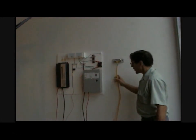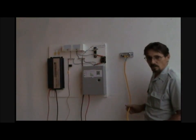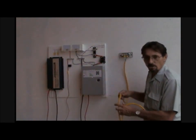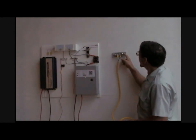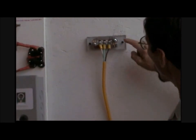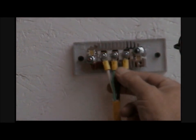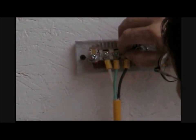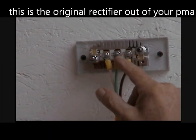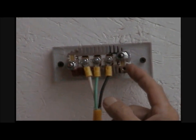Here's our charge controller board. Say we decided to use the three-phase AC outlet on the wind turbine — here's our extension cord, it'll just come into the garage, your shop, or wherever you've got it. This block is a bridge diode; it gets mounted to the wall. This is your extension cord from the wind turbine, and the wires just bolt onto the block like so. It doesn't matter which way they go. What this block does is change three-phase AC back to DC power.